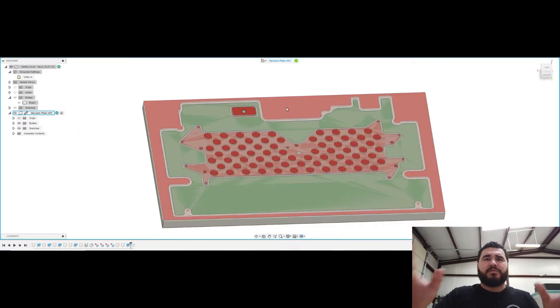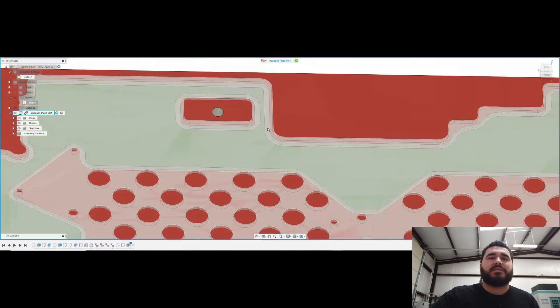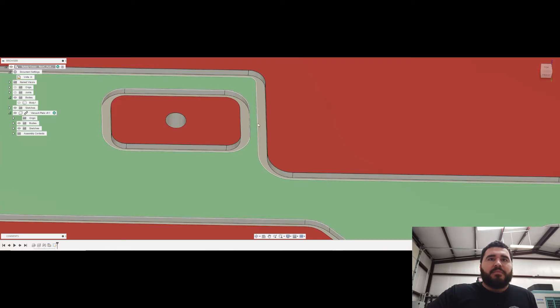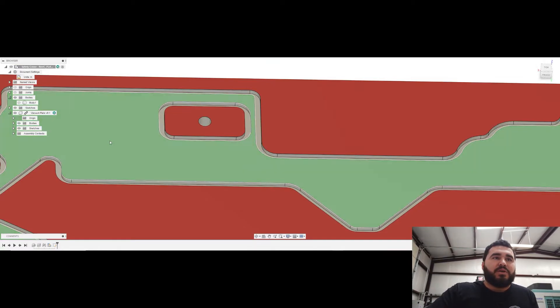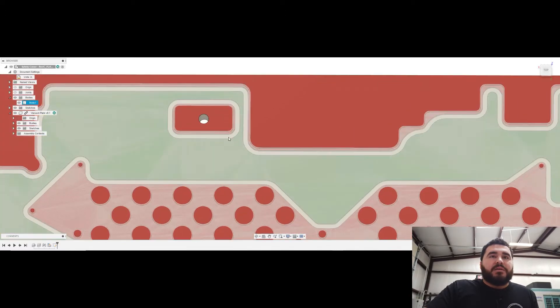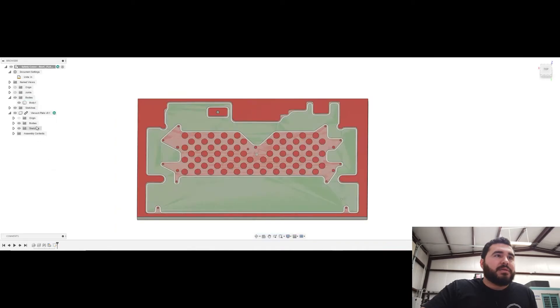The perimeter of the part is naturally vented so you don't need anything extra there. Tip four: try to keep gaskets as far apart from each other as you can. It seems like in areas where there's very little surface area for vacuum but a high ratio of gasket to vacuum area, the vacuum force in that area won't be very strong compared to a big open area. If I could move the gaskets further apart so the surface area between them is greater, I would — unfortunately I'm restricted to this specific geometry because of the window cutout.